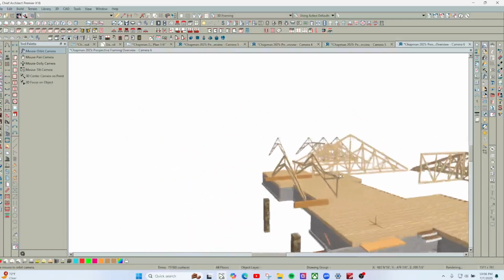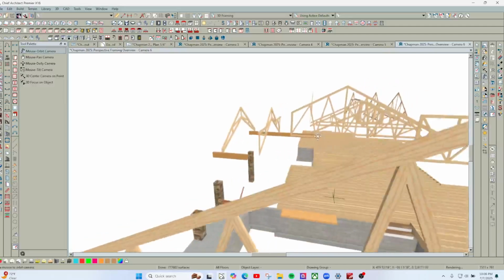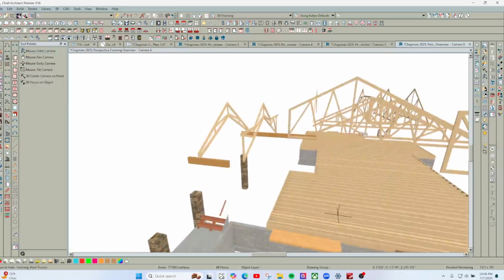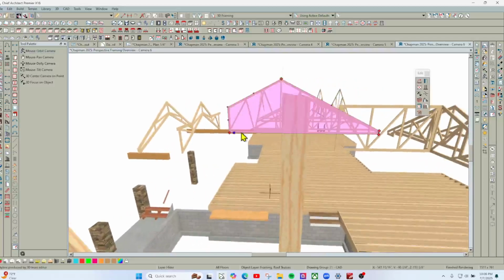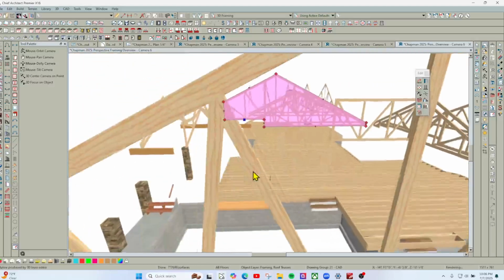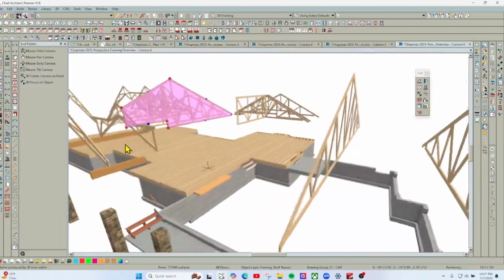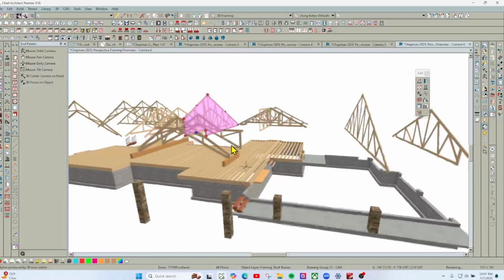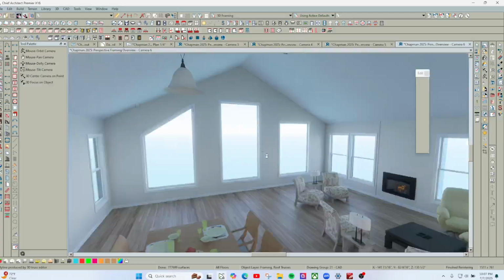And there's nothing that says when you bring these trusses across in the entry, maybe you want to pop the entry up 1 foot. That'd be easy, to lift the bottom chord up on this truss so it's the same truss profile, but in the entry we would lift this truss up like this. You'd have like a little tray in the immediate area when you walk in the entry. That's up to you, but that will give you a chance to have a higher entry there, possibly raise your front entry up to 10 foot, because this was the focal point of our previous job.